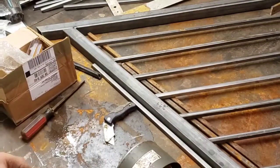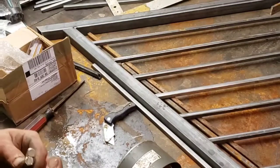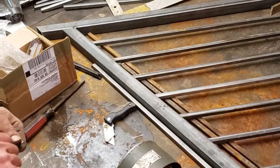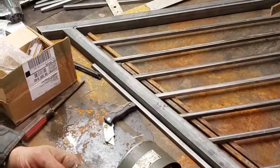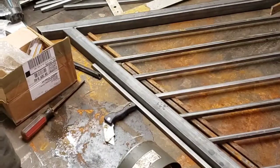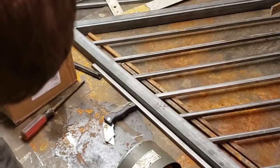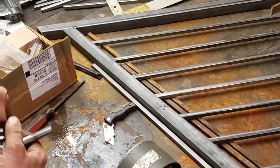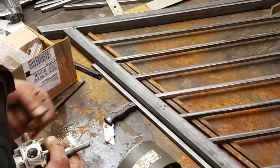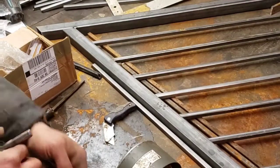I wonder if I can squeeze two magnets in one hole, but then it won't be weighted right. These things are fragile — if you let them clink together and stop paying attention, they'll pull to something and break. Once you break them and try to put them in something like this, your rotor is going to be out of balance. So I've got some more drilling to do, which sucks — I'm tired of drilling this thing. These jokers are strong though — absolutely insane, really strong magnets.